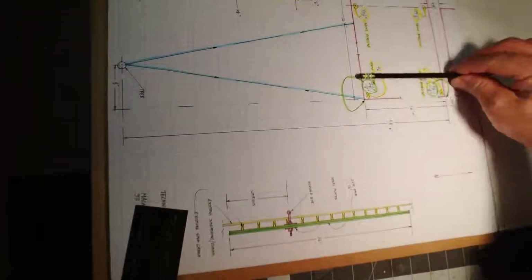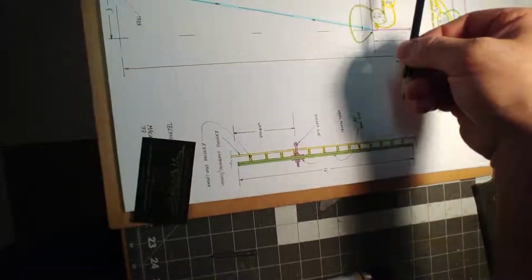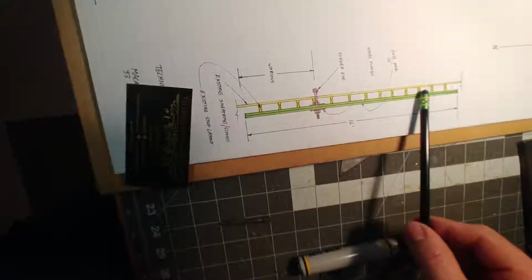And this would be that arrangement here. This is a top-down view of this area of the wall, turned like that. So we've got the outside existing sheathing and the framing structure that's in here. And then I want to add 16-foot 2x10s in two layers, a pair of them.